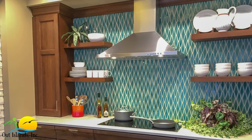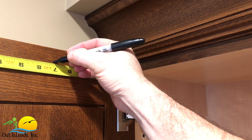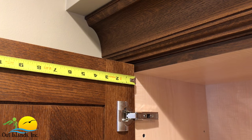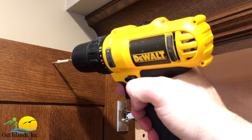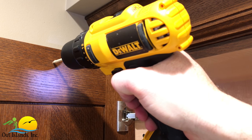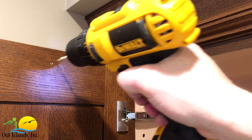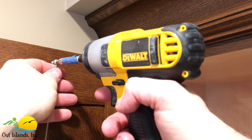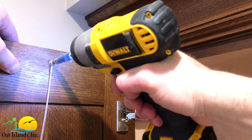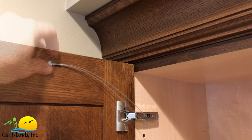Alright, it's time for our second install. This time we're going to be installing on the wall cabinet that's sitting on the countertop on the left. First, measure out from the edge of the door about seven inches and make a mark about one inch down from the top of the door. Using our drill and the eighth inch drill bit, drill a hole making sure to stop where the piece of masking tape tells you to stop. Now using the screws provided and your drill or screwdriver, mount one end of the restraint to the door. Make sure to screw this screw down tight pointing back towards the cabinet as shown.